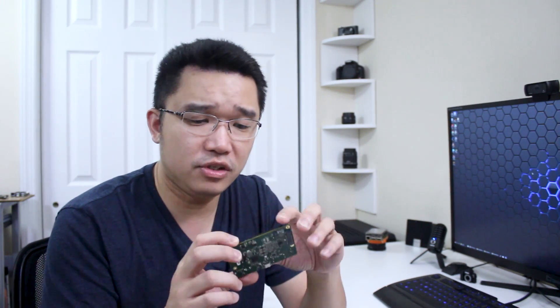It does have a 40-pin low-speed connector, but I don't find much documentation on it so I don't know how to really use it. There's also a 60-pin high-speed connector on top, and again I couldn't find documentation. The most I read about it is that there isn't even an I2C connection working on this thing, so trying to plug in a screen on this 40-pin connector will be a problem.